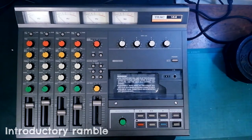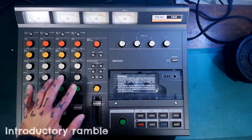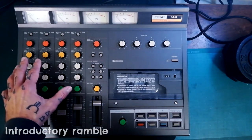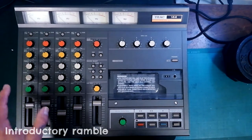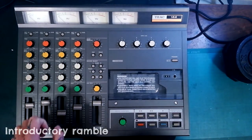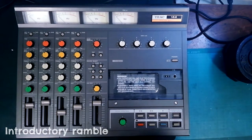If you've been following my channel for a while, you've probably heard me talk about this as being less than ideal for a beginner. The reason is that if you want to do really basic stuff like clean the mixer, it's a bit of a palaver to get in there. The way this is built, you have to remove the record and playback amplifier to access the mixer board, and then there's a metal plate over the top of the mixer which also needs to be removed before you can get in there with deoxy, compressed air, that kind of thing. So it makes it a more tedious and long-winded process to open, and you're that much more likely to lose screws.